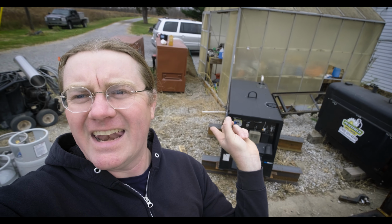Anyway, what are your opinions on the Trailblazer back there? Of my engine drives, right back there, that is the GOAT. That is, I'm going to say, the greatest of all time engine drive that I have, the Pro 400. If it's on the truck, I do not worry about any jobs that come through the door. It runs a spool gun awesome. It's got enough auxiliary power to run a Dynasty. I can have a second guy running off of the auxiliary power on it. The thing is phenomenal. I do like my Lincoln up here, but as far as money-making machines go, that Pro 400, I don't think you can get any better.